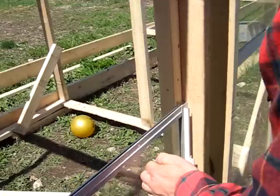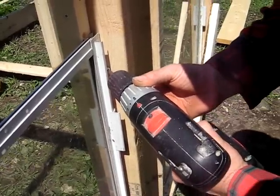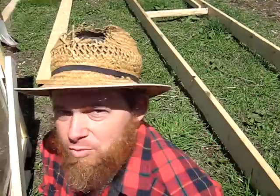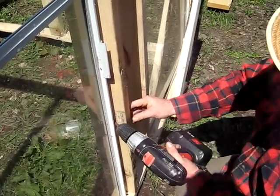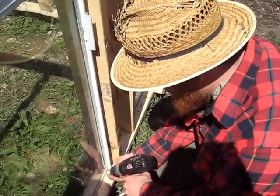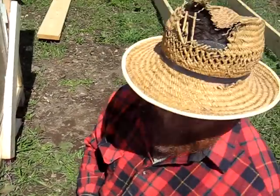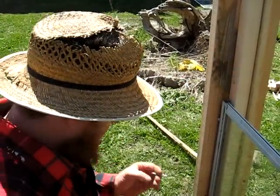Here's what I'm showing you — my wife is just holding this gently for me. I'm taking my screw on an angle. You can see how that's got that pinch now, and that'll hold it in fairly good. I'm working from the bottom up. As it turns out, the window height was just an inch too much, so I can just fill that in with some wood trim. I'm using about three screws per window pane on each side. You don't want to put them in too tight because there's no sense in pulling the steel away from the glass — you might break it. See, that ain't going anywhere.